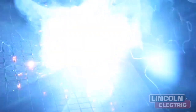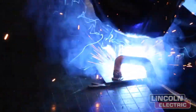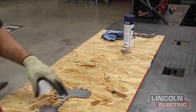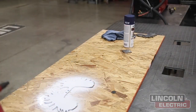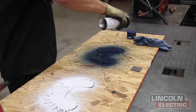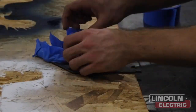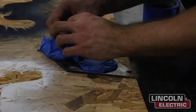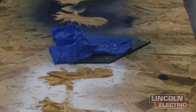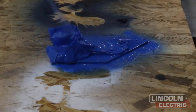We had two different approaches to welding the two designs together to make up a single hitch cover. One approach was to weld before painting, like we're doing with the Nevada and the Deer design. The other was to weld after painting. The difference is kind of negligible — the welds poke through, and the time spent repainting was about the same as using scotch blue painter's tape to achieve two different colors on the Nevada and Deer design. It all depends on your specific design and how many colors are going to be on it.